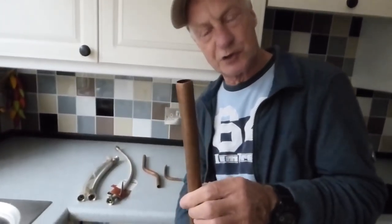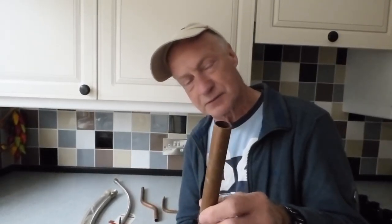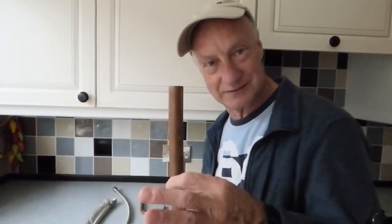Also quite widely used is 22mm pipe. You'll find this on central heating runs on the first part of circuits, gas feeds to combi boilers before it gets to the boiler — the last three or six feet would be 15mm but the whole run might be 22mm. Also cold feeds from roof tanks to give adequate pressure are run in 22mm, and the hot feed out of hot cylinders on F&E systems will be run in 22mm, then reduced down to 15mm to feed the taps. So this size is quite widely used — not as popular as 15mm but still widely out there.